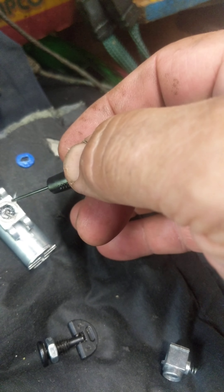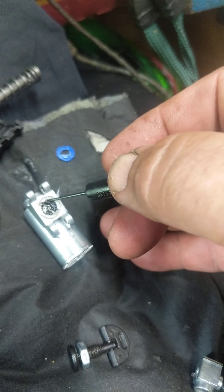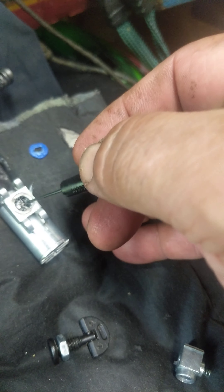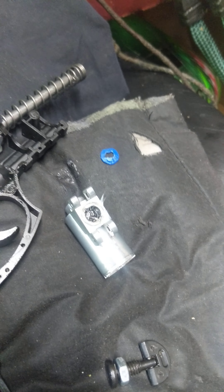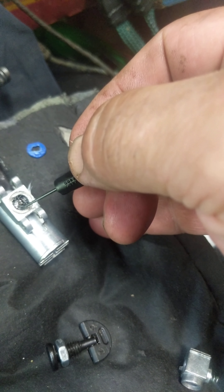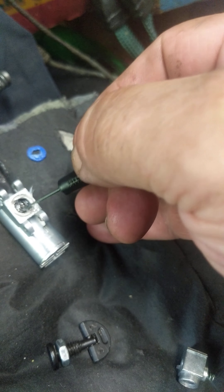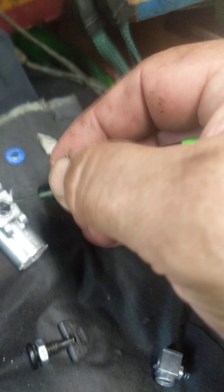The only other fix you could do is shave the thread away a little bit on this nut — it would be a little harder to do — shave that thread away so the mouth of this nut would turn in and compress it. Or if you had a steel shim of the right size, you could put it on the outside here and compress down on that seal. That would work too. As long as that seal gets compressed, it'll seal the joint. I don't have any leakage whatsoever.